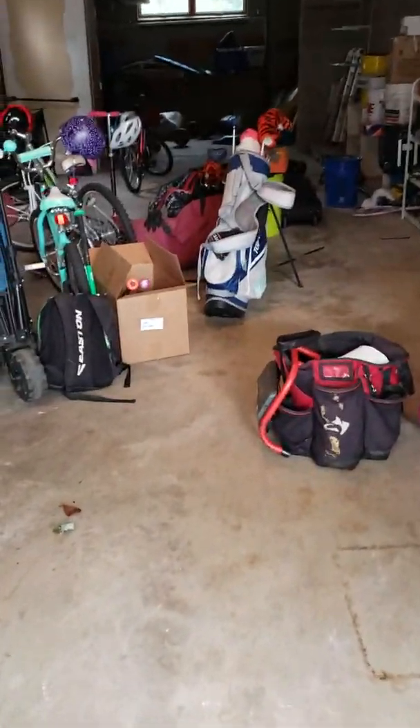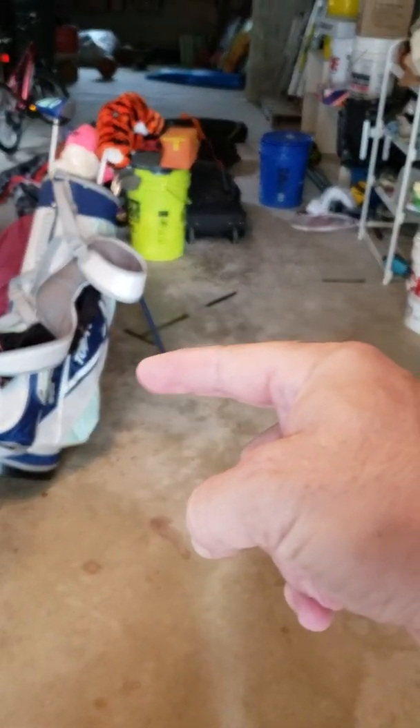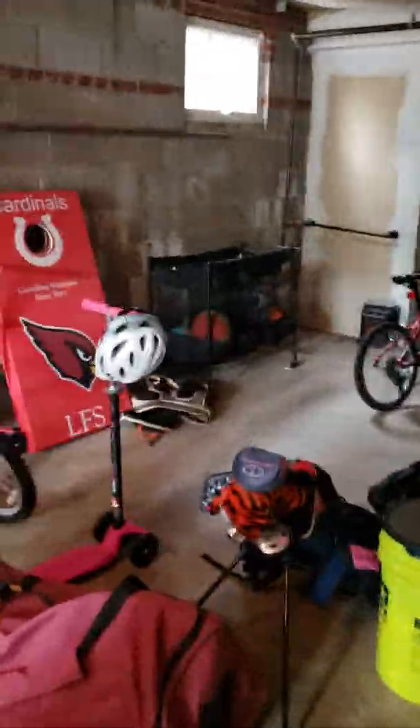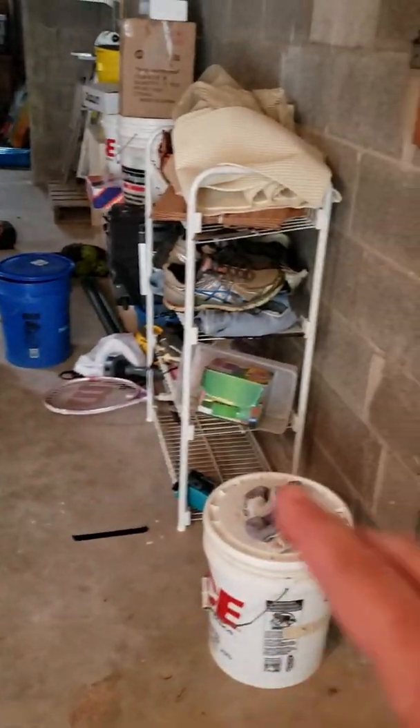So I'm in your garage and this is what we got. The sewer runs through here, comes over here. This is the pipe that we've relined — the reline starts right here. The reline looks great. I was pushing a lot of stuff to our area and letting it flow out. Now the pipe is destroyed. It's trash all the way through here. There's roots going straight back to that wall back there, and there's roots in the hairline crack all the way down it.